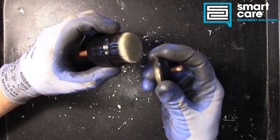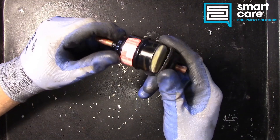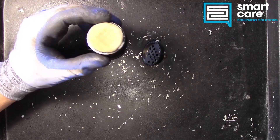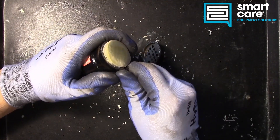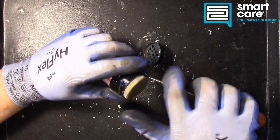So we're opening the outlet side of the filter dryer. When we call it a filter dryer, it's because it's doing two separate tasks but in one body. The first part — the filter part — is capturing any physical debris that's floating around inside the system.